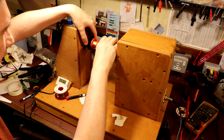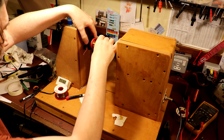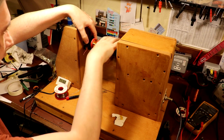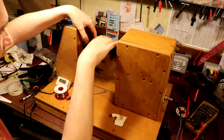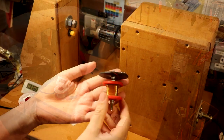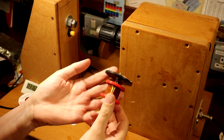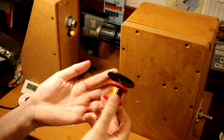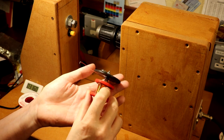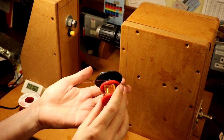Unfortunately I've actually got to take this out of here now — the reason being is I've got to make a little hole in the side of the bobbin core to actually take the feeding wire through. So hopefully you can see that — that's our primary wound. I'm hoping that we've got enough room to get the secondary wire on. There's only 76 turns on it so I think it was only a couple of layers — it may even have just been one layer.